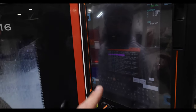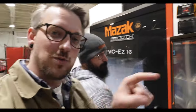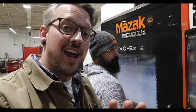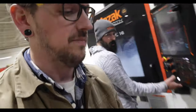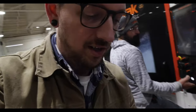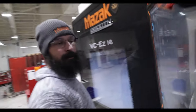There's an X pattern, a Y pattern, an I pattern, and a J pattern, and then the F — the feed speed. For non-machinists: X is left to right, Y is up and down. I and J add a radial movement — a sweeping pattern — like for the finger choil, so it doesn't just jump across and jag it, it has that nice smooth arc. And F is how fast it goes — feeds and speeds.